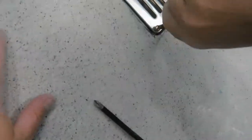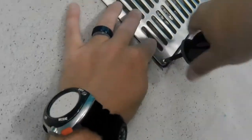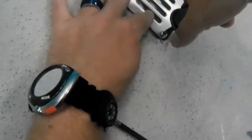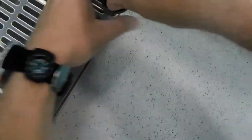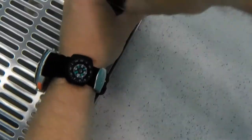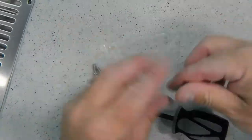One thing you'll notice is I never directly get on top of these grates. I always stay on the outside as I'm replacing the screws, which keeps me safe from delta P. I want you to look at how large these grates are. Even if I was to lay down with my belly covering the center, since the grates are larger than me, more water can move around me and I can very easily swim or pull myself away.